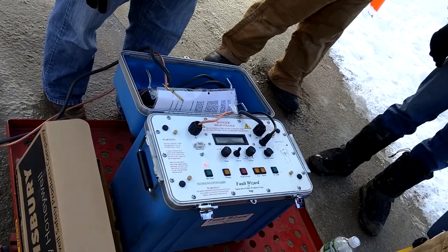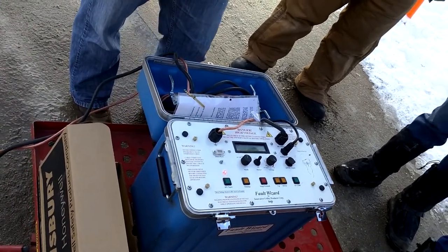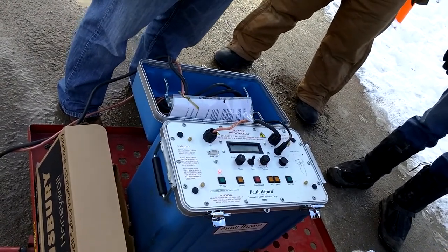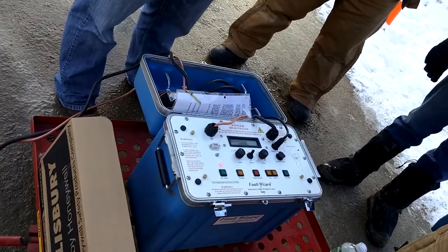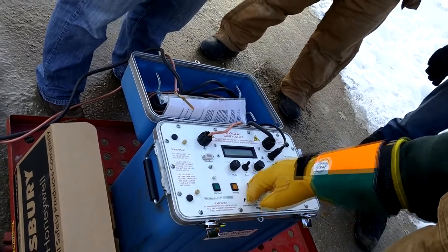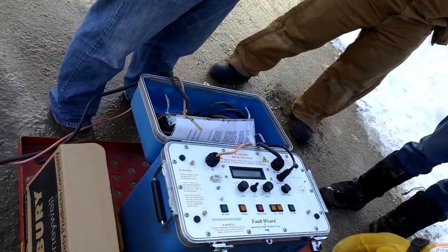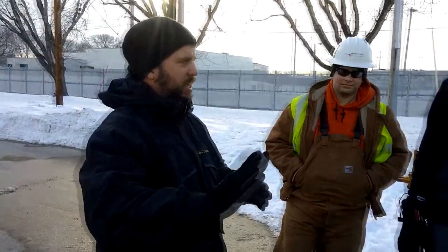You guys know it's a lot louder when you get out there in the field — this is nothing compared to how it's going to be on an actual primary cable. Every primary we've had hooked up to, it's been difficult to hear. It depends on the depth and what type of fault it is too. Sometimes if it's shooting to ground because the concentric is too far away and not arcing to itself, it won't give you a good pop. If it's beyond five or six feet deep or there's frost, or if it's in conduit, it's hard to hear — it just echoes down the conduit. If you have a listening device with a magnetic field sensor, that will sense the discharge and take you in the right direction without needing your ears, which helps a lot in a noisy environment.